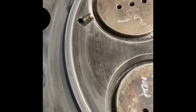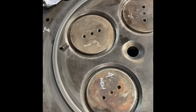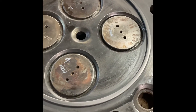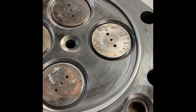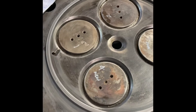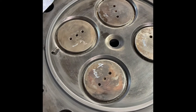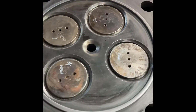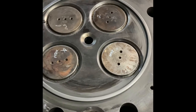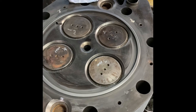The liner has to be done the exact same way. And it's very important that all the lapping compound is cleaned off with soapy water, some brake cleaner, and suitable cleaners like that to get all that compound out of there — especially in the valve surfaces as well if the valves have been lapped, which we had just done. So this whole head will get completely cleaned up, crated, and made ready for a future installation. But when the time comes, the surface area on the liner itself will have to be lapped in the exact same manner.